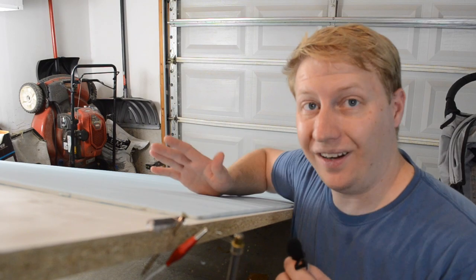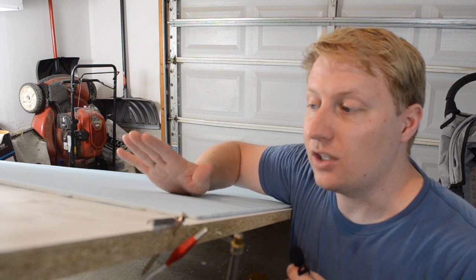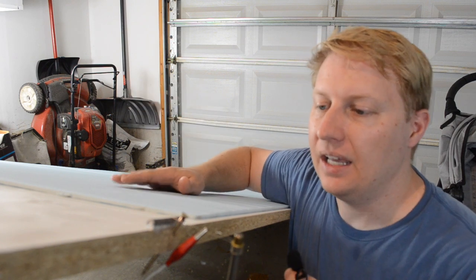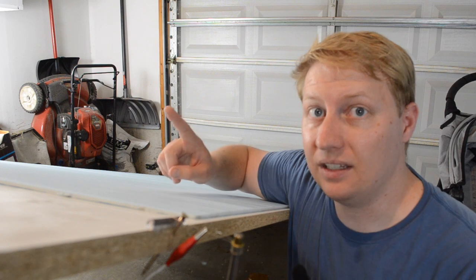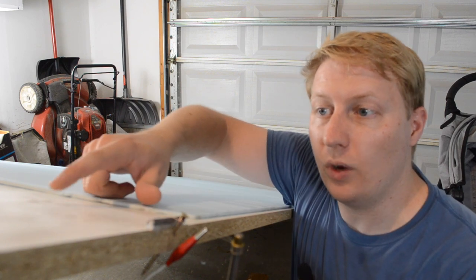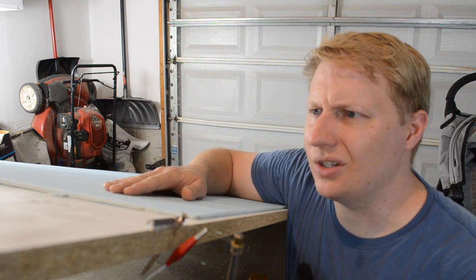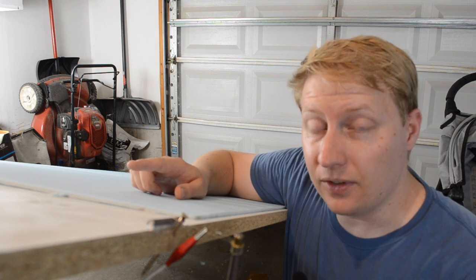All right, so I went on the internet to get some advice, asked around on a couple forums that I'm in to ask what the heck I should do about the undulations in my cut. And overwhelmingly, I got two responses: more heat and a different wire. I decided to switch the wire first. I switched to a nichrome wire. So this is, I believe, 30 gauge nichrome wire. I think that's 0.012 inch diameter. That did not make a difference by itself.